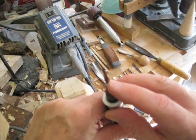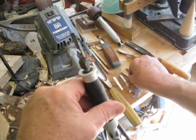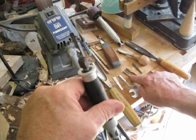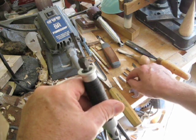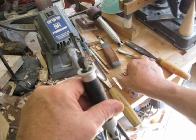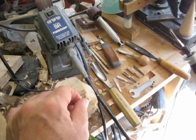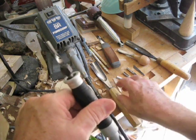Here's a little V-tool on this one, here's a little veiner — pretty small, about an eighth inch. There's a small, maybe three-eighths gouge — that's probably a number three or five. This is a three, very shallow. And then there's a flat one and then there's a skew. Those would be great for detail work, but I started looking into whether I could get bigger ones, and they come as large as one inch.